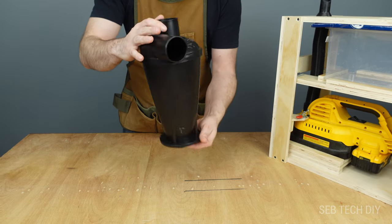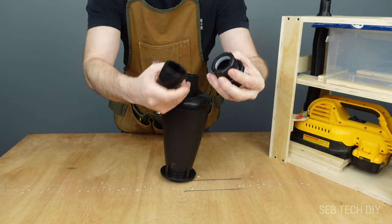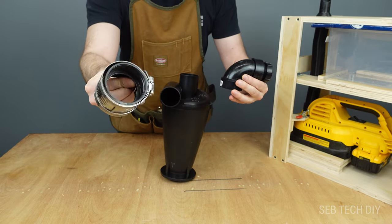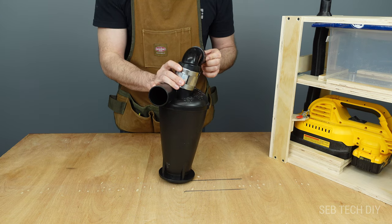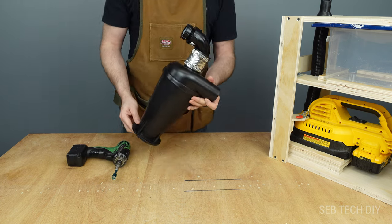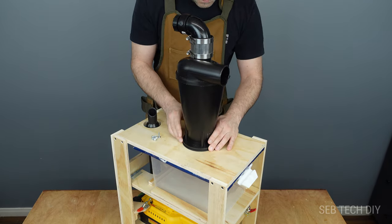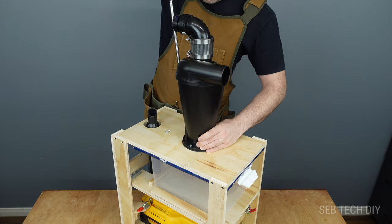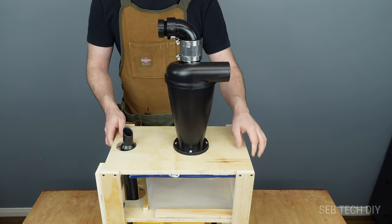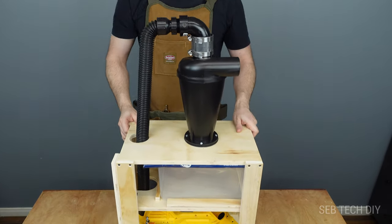Time to bring in the dust separator — this is the main component of the cart. I add a one-and-a-half to one-and-a-quarter inch adapter and a one-and-a-half inch 90-degree elbow. I also need a two-inch rubber coupling to connect the elbow and the separator together. I tighten both screws on the coupling to make it airtight. To install it on my cart I place the seal around the hole then screw the dust separator in place. I now have a seal under my dust separator and also around the top of the container, so I can finally connect the system together by putting the hose of the vacuum inside the ABS reducer.